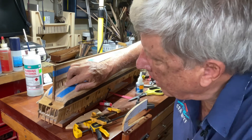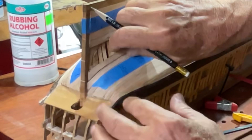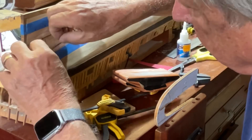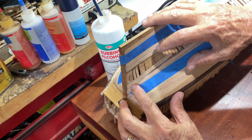Now we've got a rough shape and we start to hand work that in. The first thing we do is correct the angle that this piece is going to touch the stern. If you look at that, we've got a pretty good fit there, and then when we pull the clamp down we'll have a perfect fit.